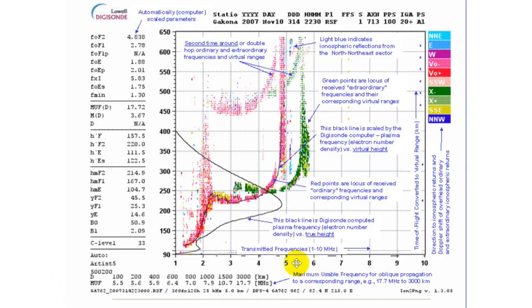Let's take a look at the output of an ionosonde — this one's at Lowell University, a Digisonde. The horizontal axis is megahertz, one through ten in this instance, and the vertical axis is height above the Earth in kilometers. You can see the reflecting layer right here. The ionosonde sprays signals in multiple directions, so you get some spray up and back. This black line is a computed plasma frequency — electron density versus true height — calculated from the strength of the responses.